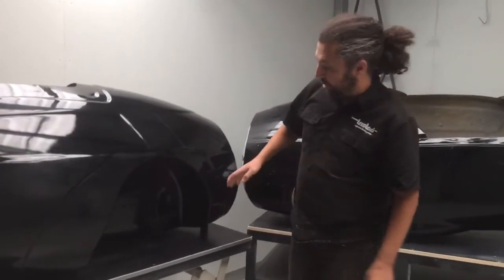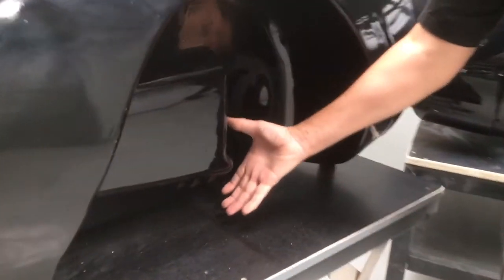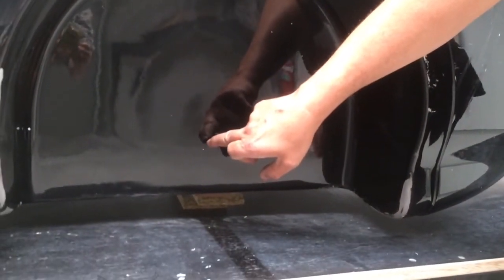Just quickly, we have more features inside the wheel arch now. This actually grabs directly onto the chassis, so the chassis has a lot more hold than the Aquila 2. You'll see the Aquila 2 pattern just literally trims that out to fit and has lots of layers here where the chassis would bolt on. In this case, we're actually using features to create that strength. So we're expecting the front hoop interaction in the cell to have a lot more strength, which is where most of the major impacts we're seeing in the vehicles are.